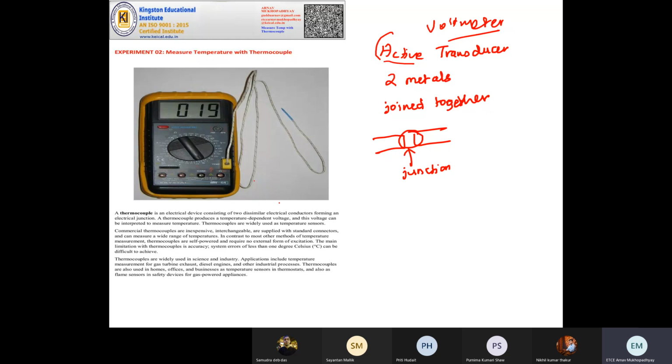being sensed. So thermocouple is the most widely used temperature sensor. Remember, there are three: RTD, thermistor, and thermocouple. But thermocouple is best. So what if other systems are used? There are others. We will come to that. For now, we will focus on thermocouple. Thermocouple is the best one, widely accepted, and its response is very fast. Another important fact is it's cheap, and they can be interchanged.